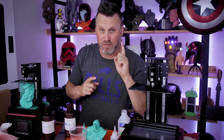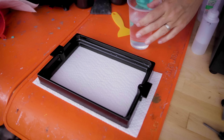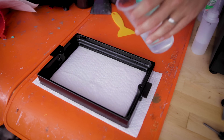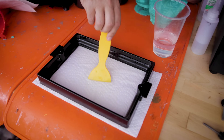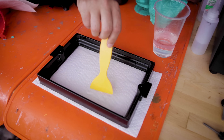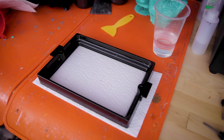So let's try our water test here first before I decide to ruin my Saturn screen. Let's pour back in some water and I'll use the spatula to swish the water around a little bit and see if it leaks through. It's not leaking through, so that's looking pretty promising — but there is a lot more pressure and force applied to this FEP sheet as the printer is printing.